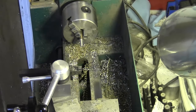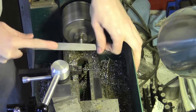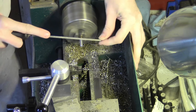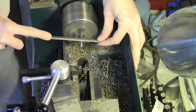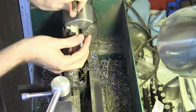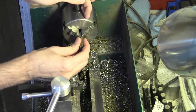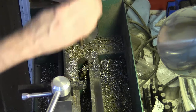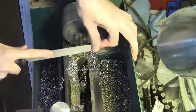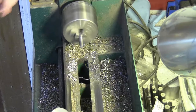That's perfect actually - I don't have to do anything. Now we're just going to chamfer it and try to round this over a little bit just to give it fewer things to hang up on. We'll chamfer this bit here. That's it for this end of the part. Now we get to flip it around, face the end, and polish. I'm going for a final length here too so that they're all fairly similar. That part is done.